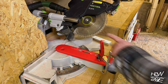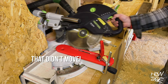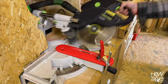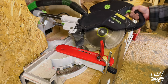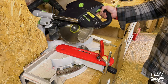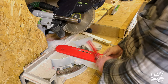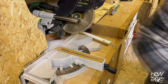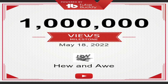In the end, I remembered doing a review on these clamps I've been using solidly for about four days with a lot of jigs involved. As far as I'm concerned they're much better than the Festool clamps I have — the holding power of those red clamps is phenomenal. I wouldn't have got away with a cut like that with the Festool clamps. When I was making that cut I was doing it in shallow passes, one after the other — going forward, lifting the blade, coming back, then back down again — probably five times through.